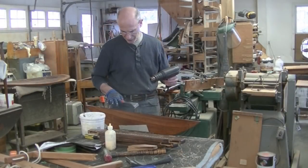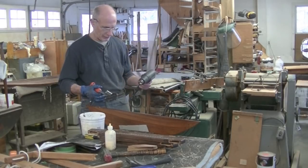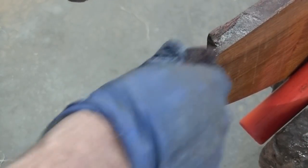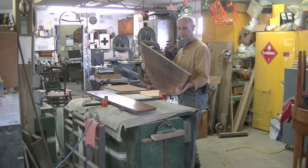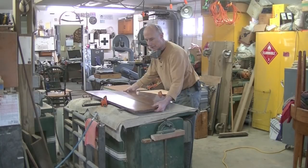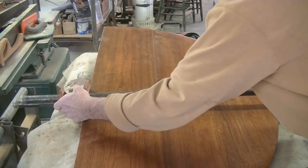These two edges on this half — the glue is so globed up on here — I'm actually using all the techniques at the same time: I'm heating it up with the heat gun, scrubbing with the vinegar and water, and then when I really see that it's loose, I'm gently scraping it off. Alright, I've got these joints as clean as I can get them. I think I'll put this together and clamp it to see what it looks like. It's coming together, not bad.